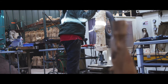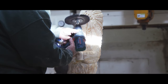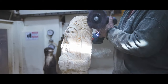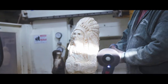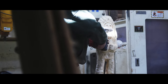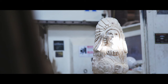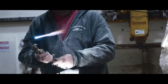We're sanding the base up there now, get that all cleaned up. As you can see, we're just brushing them down, getting them all cleaned up. These type bits work really good for just getting the big fuzz off. We're still burning to get the fine stuff off, but it's way more economical to use the saber bit to clean the big fuzz off before you burn it, because it just sands off better than it burns off when it's thick. Once it gets thin, the fire does a better job. Radial brushes — they're impregnated with an abrasive that helps them sand. This is the coarsest one.